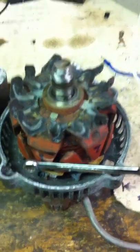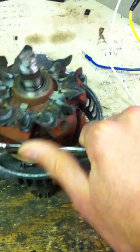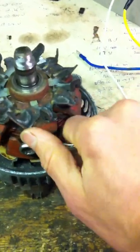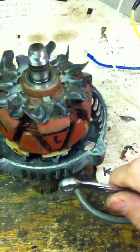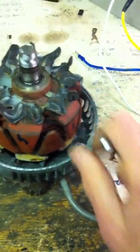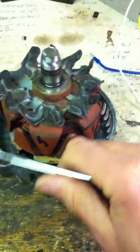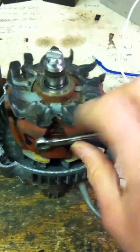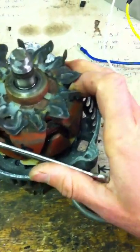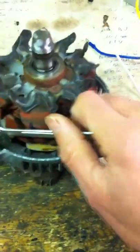If you've got 24 volts, you've got about 8 amps. 8 times 24 is 160 plus 32, so about 200 watts. Now, if you're running this at 3 kilowatts and you're putting 200 watts into the rotor, it doesn't really matter. It's a parasitic loss for a strong magnet — I'd take that.